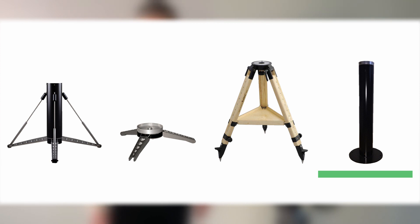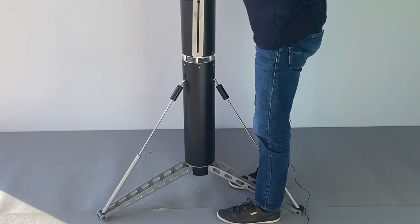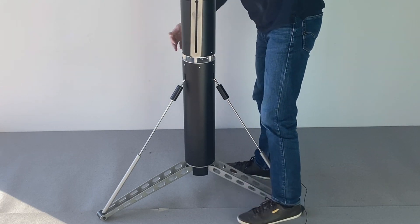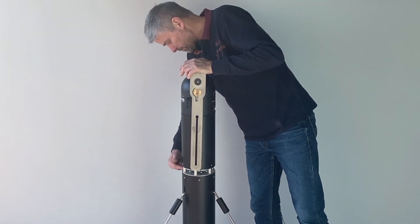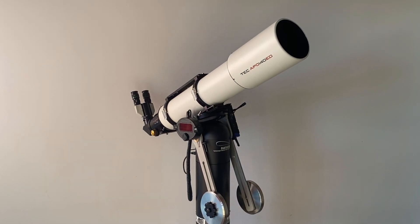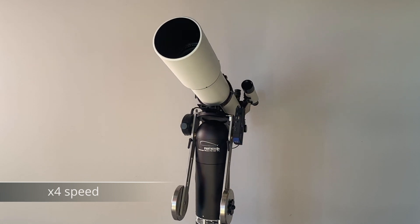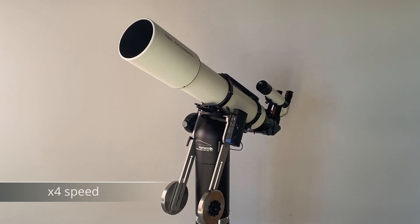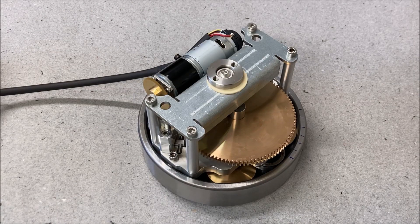The flexible design is open for many solutions. The lower part of the mount head attaches to the pier and remains fixed. When the mount rotates in azimuth, the top part of the central cylinder rotates together with the arms and telescope saddle. The azimuth axle is vertical, so no balancing is needed. The azimuth drive is a special design combining a traditional worm gear with a friction roller gear, securing very smooth operation within a limited envelope.